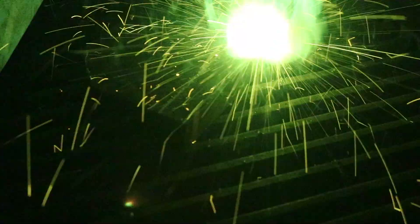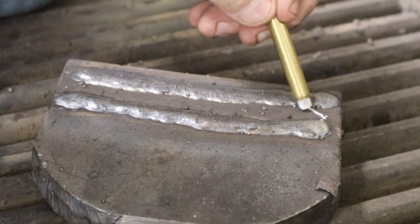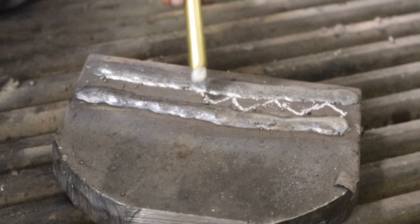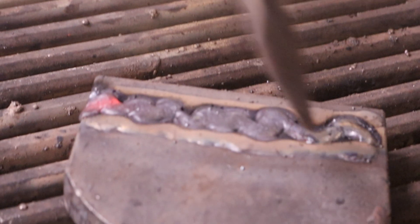So you're going to show us a little bit of this right now. I'm going to actually simulate a weld that would be done on a ditcher rail. When you're welding on a ditcher rail, it's a good idea to weld on each side of the ditcher rail, and a zigzag pattern in the middle — especially on wider ditcher rails — to give you the best wear pattern and also making the weld economical.